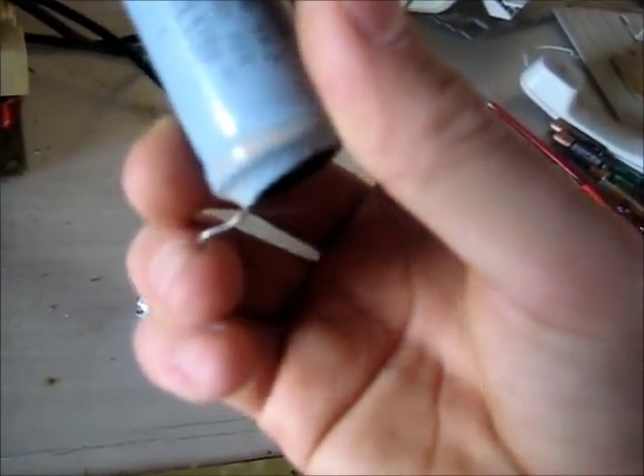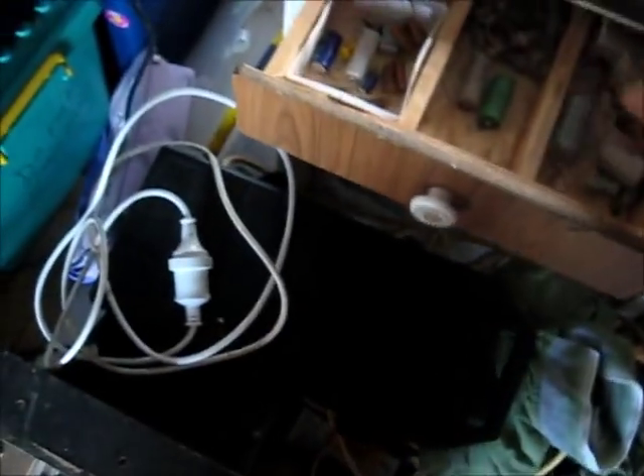I've got more. This is another one made by the same brand. It's a 24 microfarad rated at 525 volts, and it too has a little bulge in the corner. There would normally be a vent. This one has a slightly different coating on it, looks like cloth tape texture. The writing's half scratched off. It's a 24 microfarad, 350 volt. And I don't think that has a vent on it, so that one is unvented.